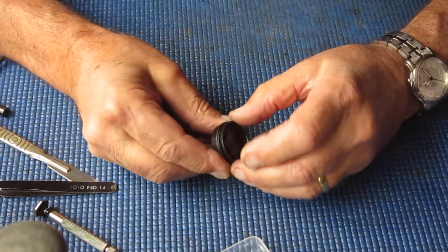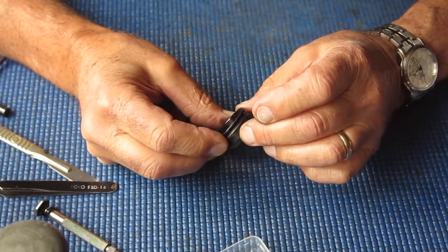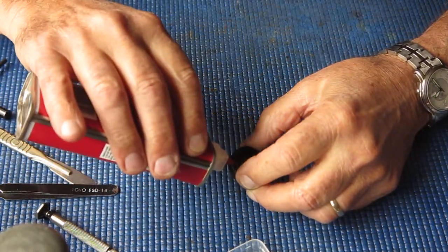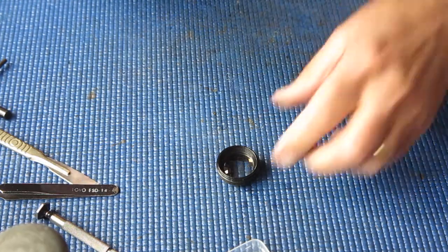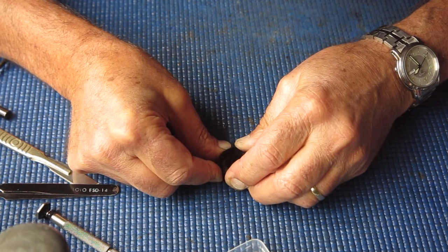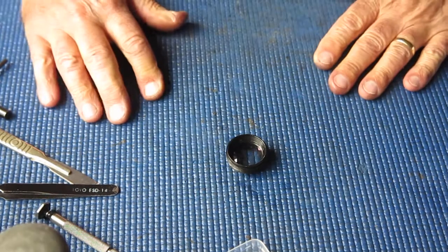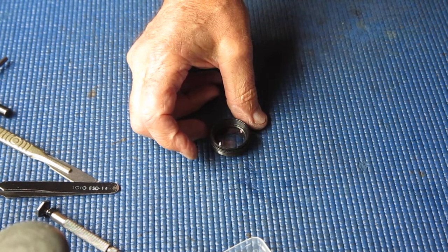There's the focus scale ring — that's off. No sign as to why that should have been stuck on there. And yes, the middle lens group is unscrewing from the body of the shutter. The front group is not unscrewing from the middle group, exactly as I suspected. We put our shutter aside — here is our problem. This piece should unscrew from here. I'll try that with a bit of solvent. First I'll try a little bit of naphtha and hope that it wicks down that thread and softens the grease. Nothing. I'm going to warm this lot up with a hairdryer and see if that'll help — made absolutely no difference.